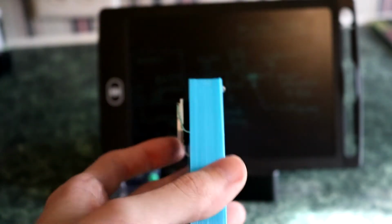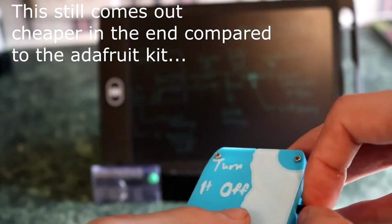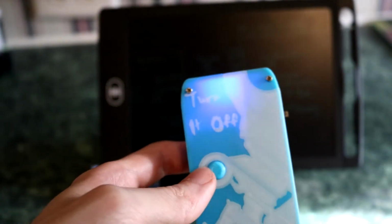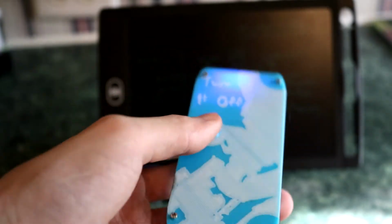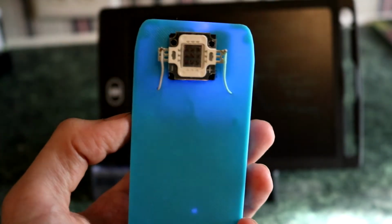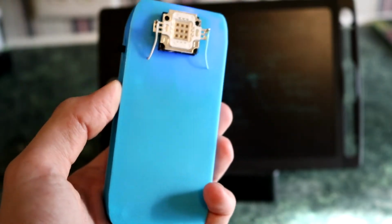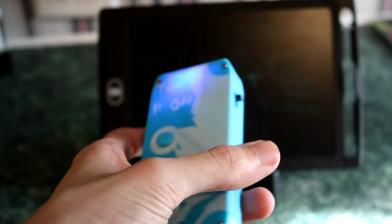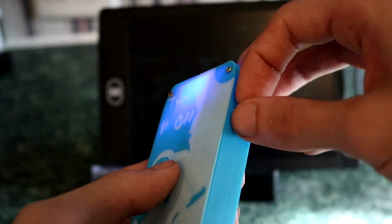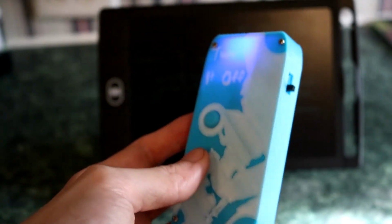Essentially, like I said, you'd typically use an AT Tiny, although you can use any kind of microcontroller capable of holding the code and blinking an LED on and off. Anything like a USB Pro Micro, a DigiSpark, a Wemos, a Node MCU should work fine. In our particular case, I'm using a Wemos D1 Mini, just for the fact it has dual functionality. If I ever get bored of this device, I can easily reprogram it to act like a wireless deauthenticator, or I can have it act like a server or perhaps even a beacon spammer. However, for the sake of today's video, we're going to be focusing on how you'd wire this up to act like a TV Be Gone.